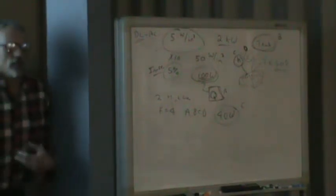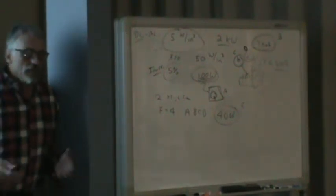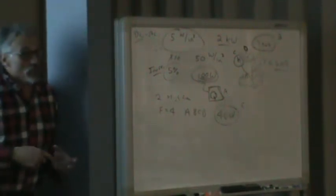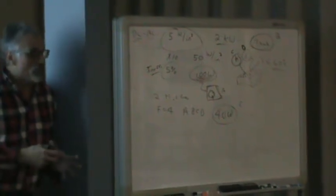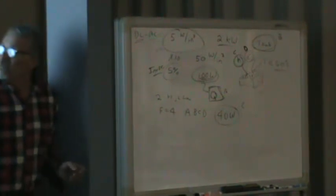My heat transfer coefficient, 1 to 7 watts per square meter Kelvin. Why? Because I did some studies, did some calculations, and it looked to me to be around 5. But again, I can't guarantee that. It depends on the air, the conditions, the temperature, the material surface. A lot of things go into this natural convective coefficient, but that's not very high. You know, 1 watt per square meter K is pretty darn low.